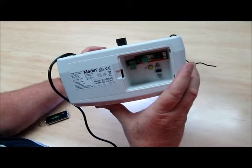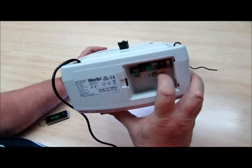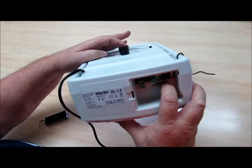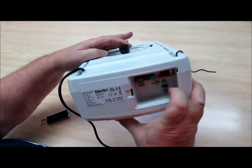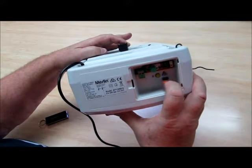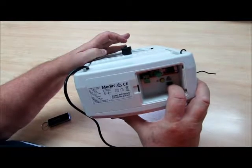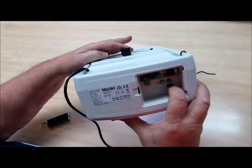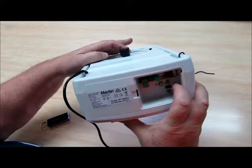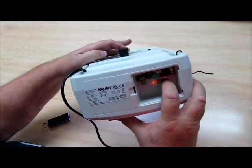On your CyclonePro, to set your limits, hold the program button in until up flashes, hold up arrow until door reaches up position. To save, press program, and then down comes on, press down to set down position. Press program button to save, and to install force, the up arrow then flashes, you press the up arrow.